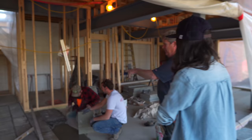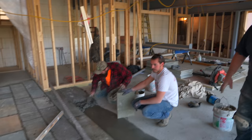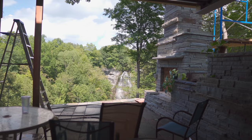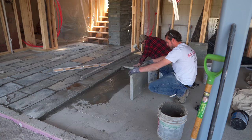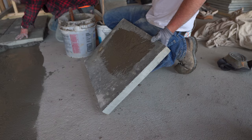So Dave, can you tell me what you're working on right here? This flagstone is going to continue right out and do this whole patio. We're going to just keep it streaking out, like the stone down at the falls are all kind of patterned that way. We're trying to continue that look, and the walls are supposed to look like the sidewalls on the falls, with these striations and layers. What we do is we first put a Portland and water mix — it helps bond everything. Then we put down our mortar mix and paste the backside of the stone with the same paste and pound them down.